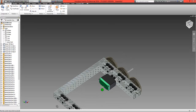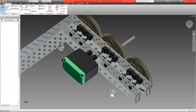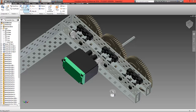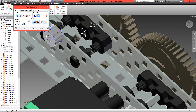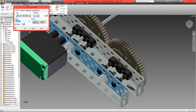There are our gears in place. Now bring in the collars: Place, locate two shaft collars — one and two. Constrain the surface to the surface of the metal and the centre line to a corresponding centre line, then repeat for the second one: constrain surface to surface and centre line to centre line. OK.